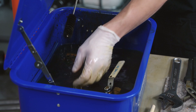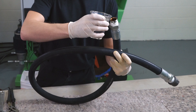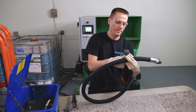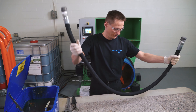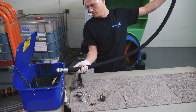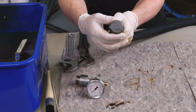To clean the fill hose, put a cap on one end and fill with alcohol. Put a cap on the other end of the hose. With a cleaning motion, move the hose back and forth to agitate the alcohol inside. After a minute of agitation, remove one of the capped ends and drain the hose. Then refill the hose a second time with alcohol. Replace the cap and store in a safe place for future use.